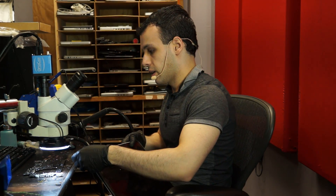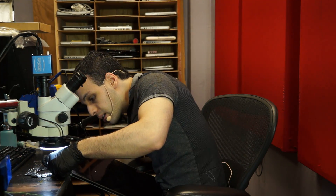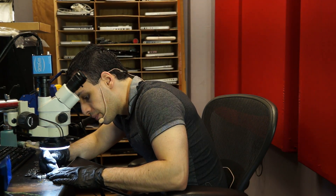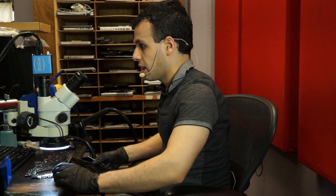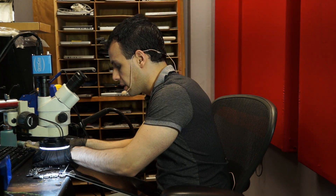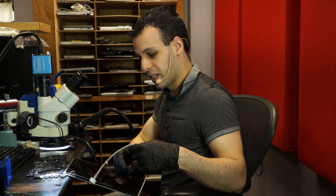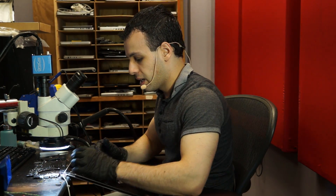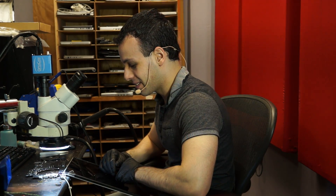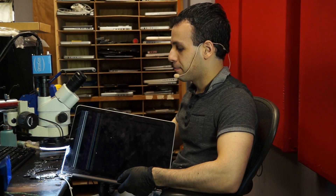Let's see if we get a picture on the screen. One thing that sucks about these retina screens is testing — this is a broken assembly, but I should at least be able to tell I'm getting something before this goes off to quality assurance. The cable is really short, so I'm going to plug in a fan so I can see that it's spinning. This is a 2013 to 2014 model, so it's not one of those where the fan won't spin when you turn it on. That's infuriating with the 2015 retina — it's almost as if Apple figured out they designed a computer that will not fail from overheating. See that? That's my screen getting powered on. And that's that.